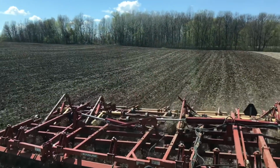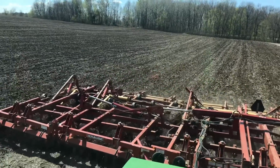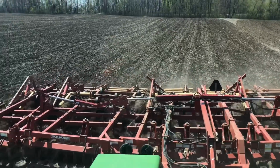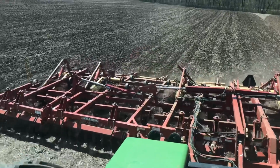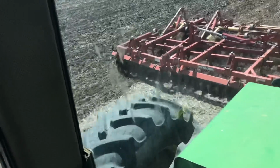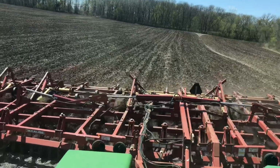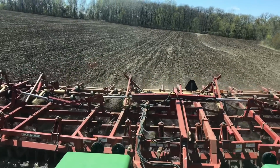We're at 0 right now just because this tractor is heavy enough and it's powerful enough, and we're not necessarily sunk all the way in the ground, but even at full depth, it works this thing just fine. But if you wheel slip and you're spinning in place faster than your actual ground speed is, you'll clump it up because the lugs are smushing the dirt as it's trying to go places. It's pulling up mud and spinning, and you leave tracks like that too. That's just not good for planting, but for today's purposes, it's not that bad.